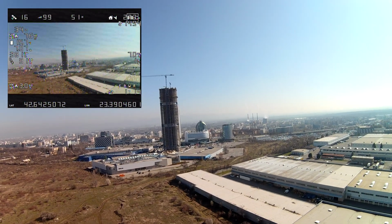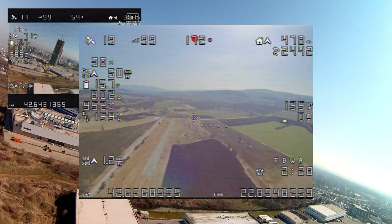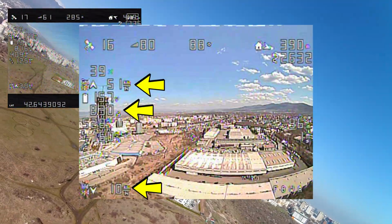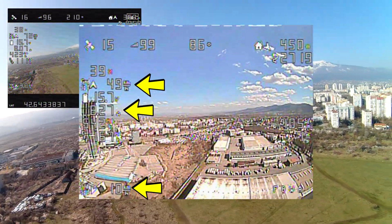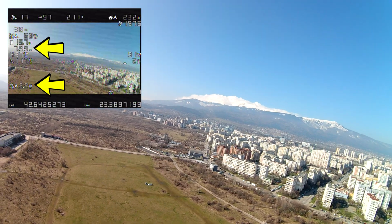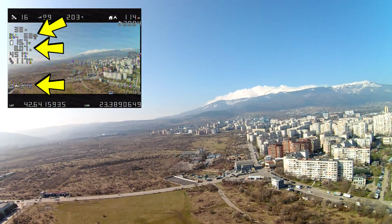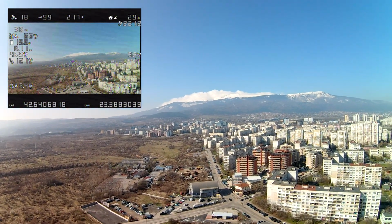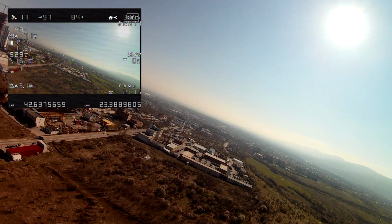Once in the air, I immediately started testing out cruise speed at the infamous 8 amps from the maiden flight, which back then, in similar atmospheric conditions, resulted in a 50 km/h cruise speed. With the motor standoff only in my previous flights, that speed went up to about 60 km/h at the same current, and with the tapered off tail, we can see that 8 amps with 3 km/h headwind does result in a cruising speed around 70 km/h, which is another 10 km/h increase from the previous mod and a 20 km/h increase from the maiden flight, or in other words, optimistically speaking, a 40% efficiency improvement over factory state.